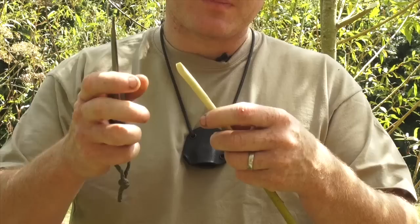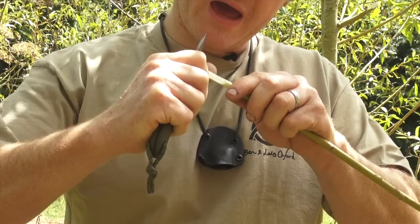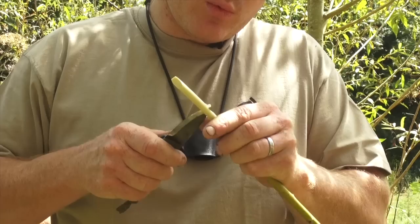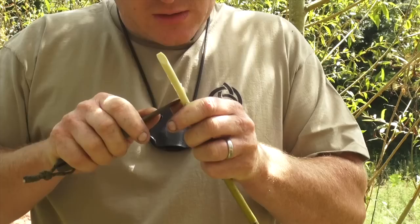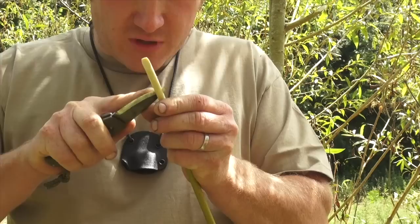You can see how it just breaks away. Take your time. If you see the split getting too deep and potentially wrecking the top end of your whistle, go back and continue with little stop cuts. Willow has a tendency to be a little fluffy when carving — it's a woolly wood — so concentrate on getting really crisp cuts. Any ragged bits or fluff left in the chamber will stop the whistle working. Carefully work back and forth, cleaning up the grain. For thickness, I use the pith as my guide — halfway through the stem is the pith, so get to the pith and just a little bit beyond, keeping it as even as possible.